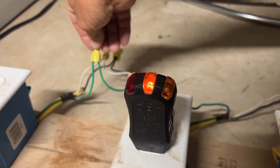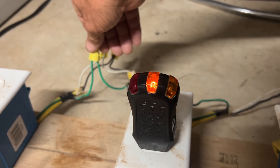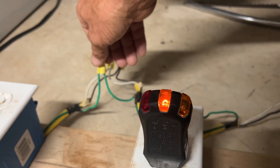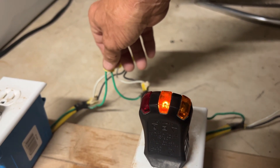To be thorough, I tried to create a poor ground connection, because many people online have speculated that the dim light is caused by a poor ground. I put my two ground wires together with a wire nut very loosely and tried to make as loose a connection as I could. No matter what I did, I either had the ground light completely off or completely on — I could not get a dim ground light. So a poor ground connection is not a very likely cause. In almost every case I've seen, phantom voltage from an EMI filter is the cause, not a poor ground connection.